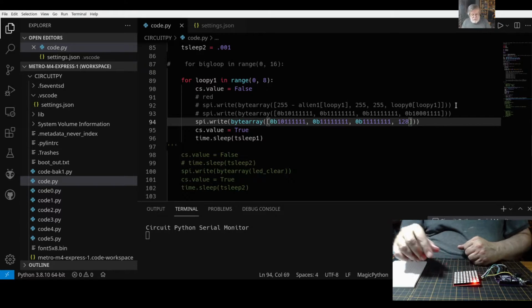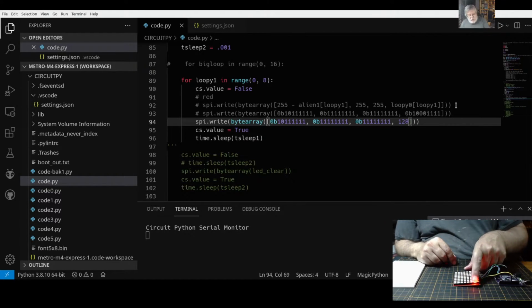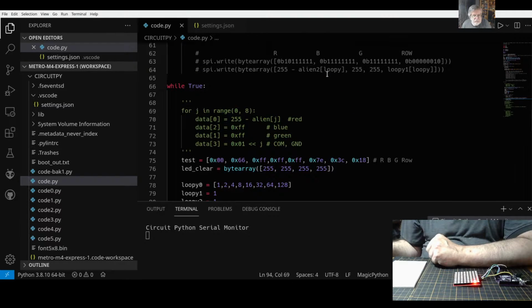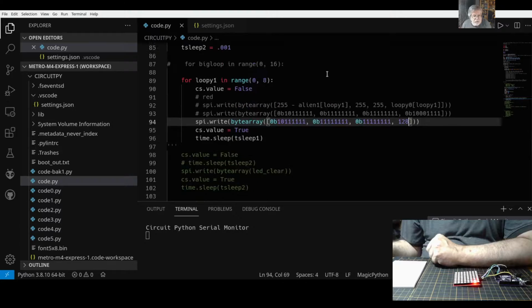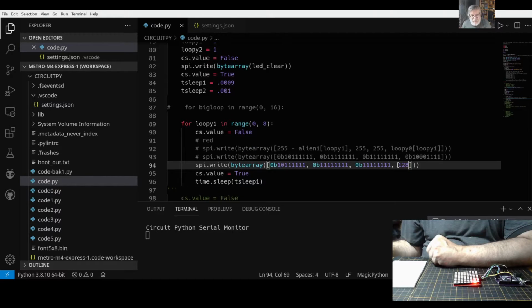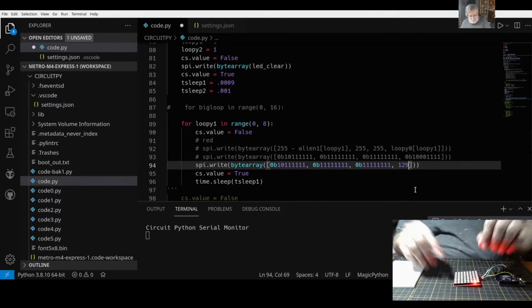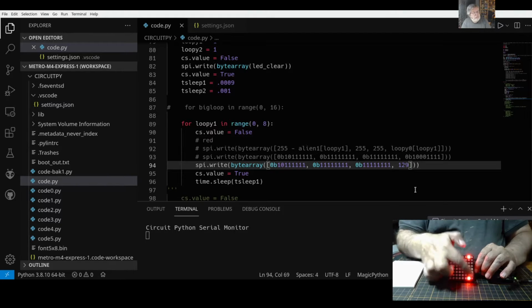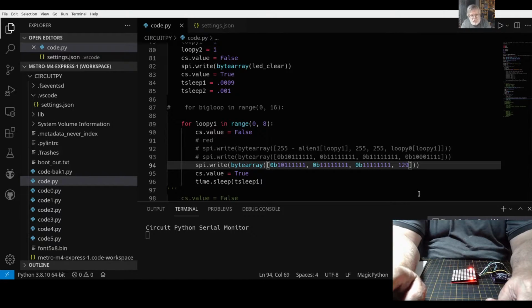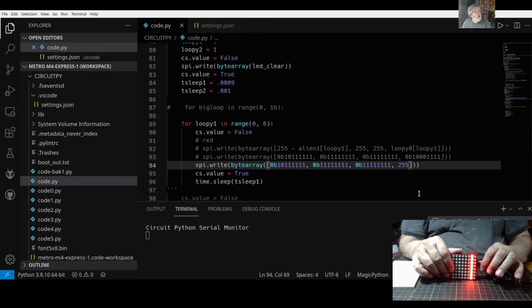Okay. Well, if you want row 1 and row 8, that light on, it's 128 plus 1. So this range thing here, do I have the notes for that in here? So if I add 1 and 128 for 129 here, we just turned on 2. That's right. You have to add them all together. So if you add them all together, 1 plus 2 plus 4 plus 8 plus 16, you get the trick. You end up with 255. All of them are lit in that row.